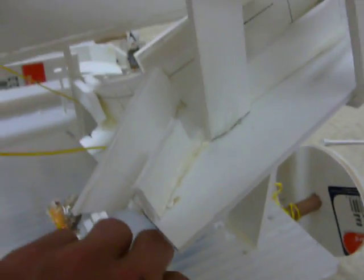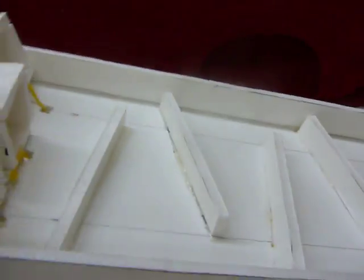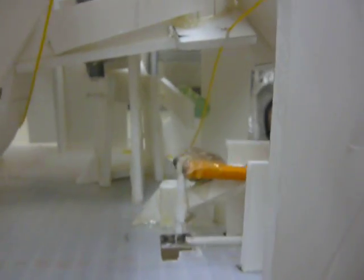Another mechanism that's kind of interesting is the drive mechanism. The way that's triggered is by the first marble coming down and, as I said before, it's routed through this maze. It comes down and lands in this bucket. This little bucket is on a lever system with this little device right here — a rubber band attached to a string that's wrapped around the axle underneath the machine.